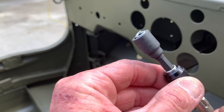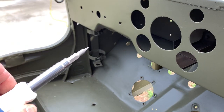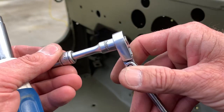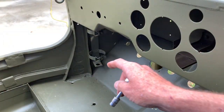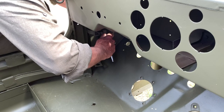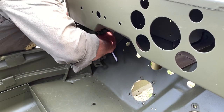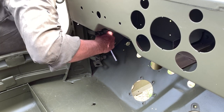Don't tighten any of the fasteners fully just yet. Get a slotted screwdriver that fits the outside head nicely so it doesn't slip, and use a quarter-inch ratchet with an extension and a three-eighths drive socket to get in behind the feet and tighten the bolts fully. Hold from the outside with your screwdriver and tighten the nuts from the inside with your ratchet. There's a little movement in the drilled holes, so as you tighten, make sure the bracket stays in line.